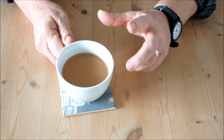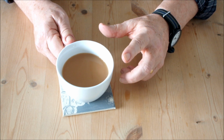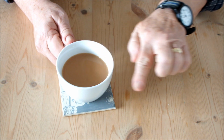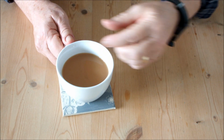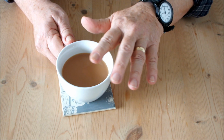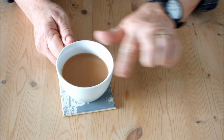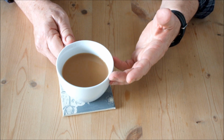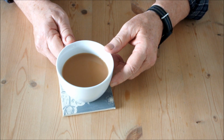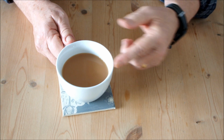Because I had more time to look at the build instructions, fortunately I'd kept those. There was a way that I could get those sheets out, and it was simple really. The guttering along the bottom edge of the roof slid into position and was held in position by 5 bolts, and it in turn held the sheets on the roof in position. So if I took those 5 bolts out, slid the guttering out, and then looking at the bottom edge of the sheets, I could get hold of them and pull them down out of the roof. And then it was a simple matter of pushing the other sheets back up and then replacing the guttering.